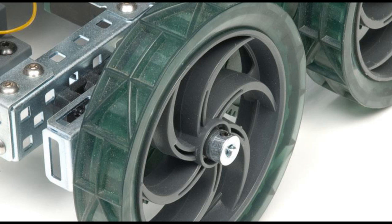Now it's time for our final segment: do's and don'ts. Don't cantilever a drive — VEX axles just cannot take it and it's far too susceptible to in-match damage. Notice how the axle is just hanging off the drive base in this example. If there is any sort of weight on that axle, it will bend and cause an incredible amount of friction on the bearing, which only makes your motors work a lot harder than necessary. Pay special attention when mounting your bearings and test the friction between the bearing and the axle to make sure it is not excessive. If you hear skipping or see wheels slipping, it's a problem that must be addressed. Make sure you don't cantilever gears or chain, as this is a major cause of skipping. Finally, minimize the slop in your drive base and put your shaft encoders as close to the motor as possible for accuracy.